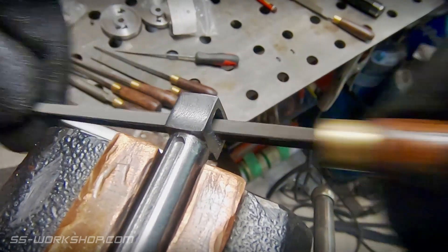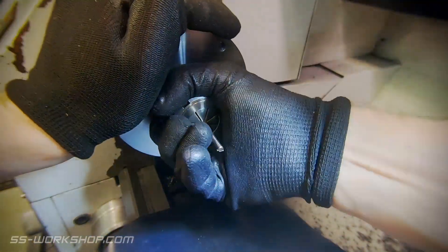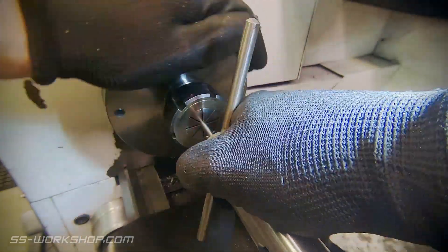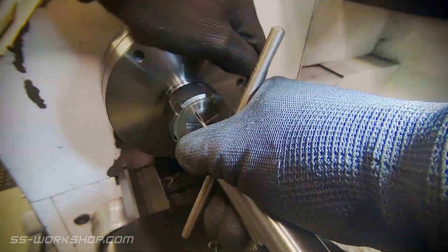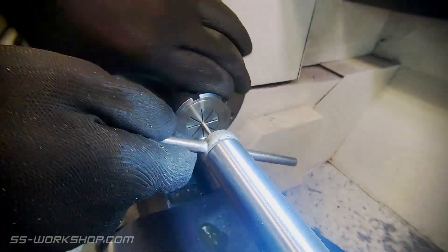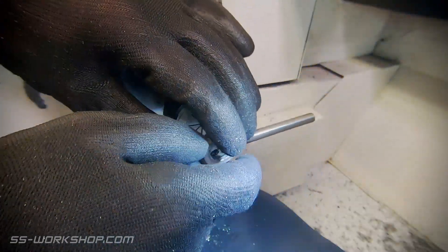Next I tackle the engagement screw, made from 4mm stainless steel rod, gripped in the collet chuck to aid cutting the thread square. I use the tailstock to keep the die square and apply pressure as I start the cut. This shaft will have a left-hand thread on one end and a standard thread on the other. I'm cutting the left-hand thread here using a left-hand die — they're not that common, but for this size it's the easiest method. A larger diameter could be single-point cut on the lathe, but there's too much deflection on a small rod.